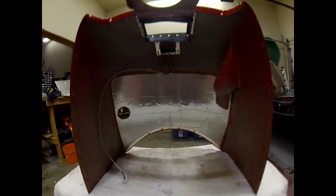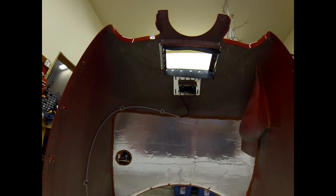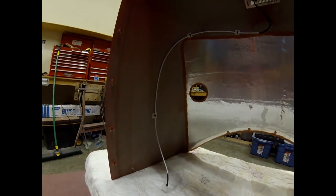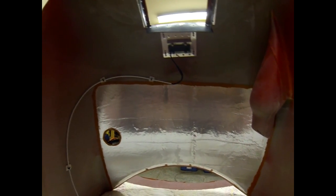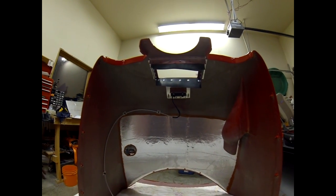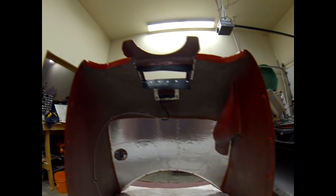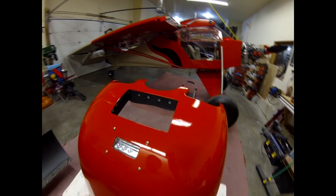The cowling — I've used the Micro Sun light and made a bracket for it, which provides fresh cold air on the turbo and the air intake. I've got the light wiring on a connector on the side so it's very easy to connect and disconnect for cowling removal. I put all the foil down and did a silicone trim around the perimeter to decrease the chance of it lifting. This one didn't stick as well as the foil on my other RVs, so I had to put silicone underneath and re-silicone the perimeter in some areas to keep it down.